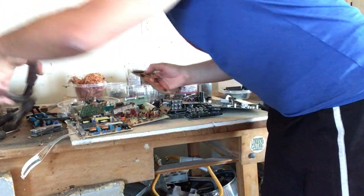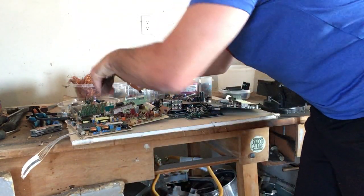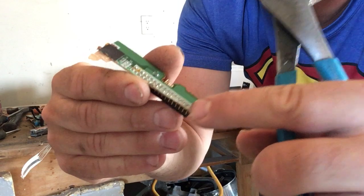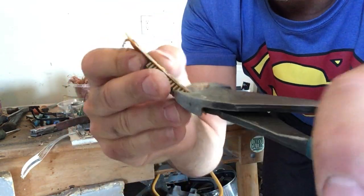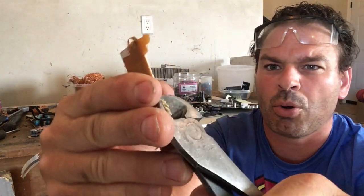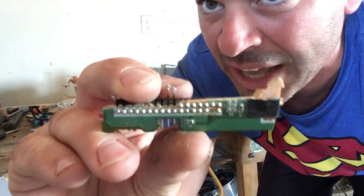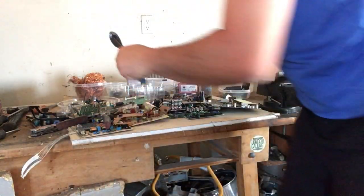Very simple — the best tool I have when working with circuit boards is actually a pair of tin snips. All I'm going to do is cut above that — you can see it cuts through like butter. Then I take a pair of side cutters and cut on those pieces of soldering to peel it up and remove it. The pins start to come up, and I just fold them up. With the flick of a finger, I pull them right out — they slide out. No problem. There are some gold-plated pins. No need to break the plastic off — they just slide out backwards.